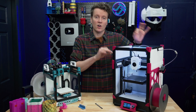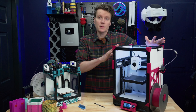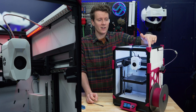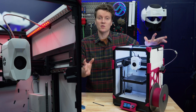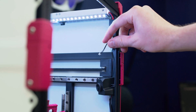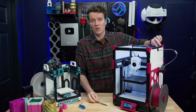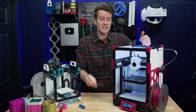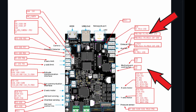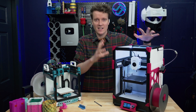The next big upgrade was adding LED lights. I went with 51 addressable RGB LEDs that are fully customizable. Since it runs Klipper, it's really easy to add fun macros — I set up one that shows the progress of the nozzle heating up. You could also go for single-color white LEDs; it already has the connector. These are 24-volt LEDs, but for addressable RGB you'll want 5 volts, and there are two different connectors on the main board, so there's a ton of possibilities for expanding the lighting.